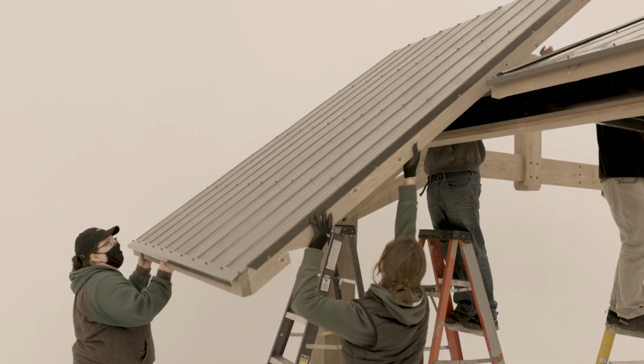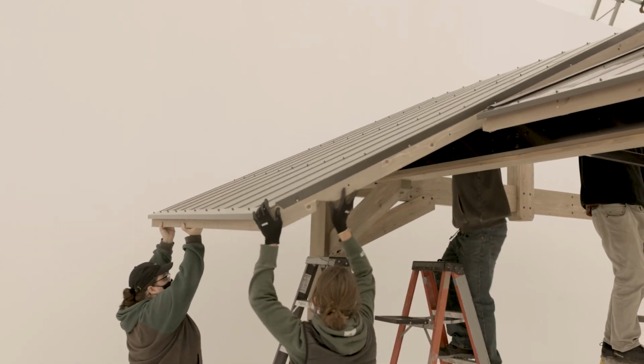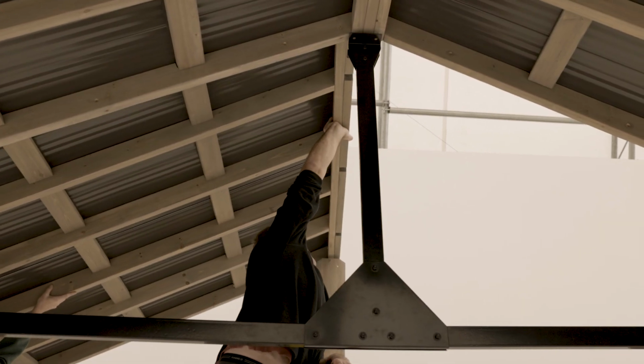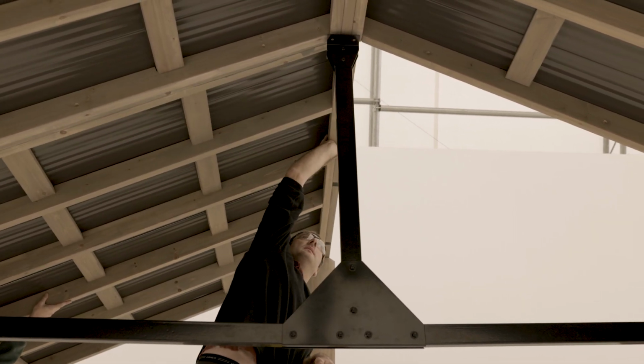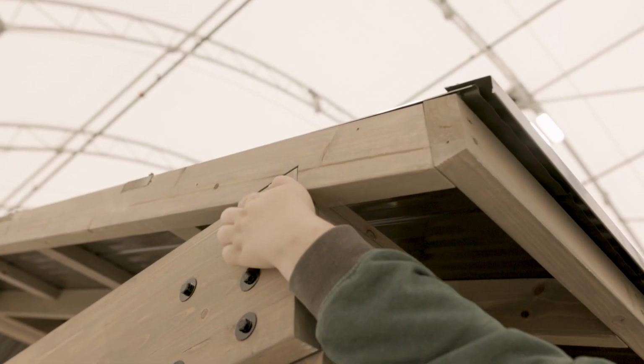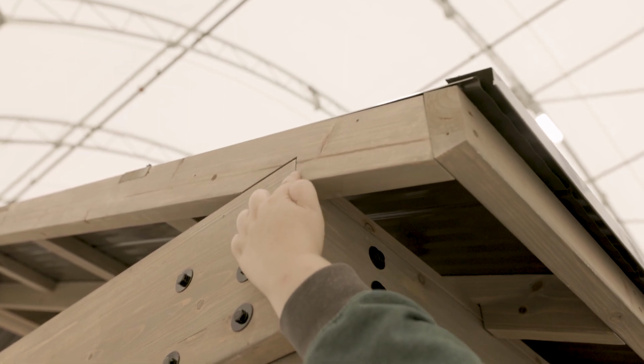Bring in the left roof panel with roof ridges and lift it up over the beam, taking care not to damage or scratch it. Place the panel next to the right roof panel that was installed previously. The center rafters should meet. Make sure the cutout is tight to the side beam on the back of the unit. Then loosely attach the center rafters to each panel.